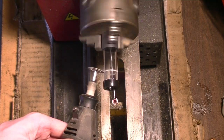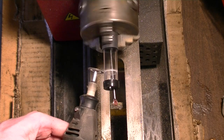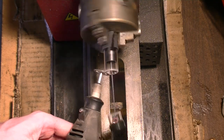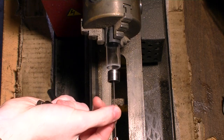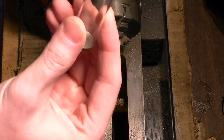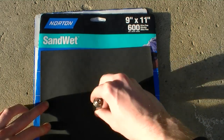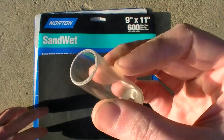This operation creates a lot of dust so you'll want to wear a mask. This cut is a little rough so I'll sand it a little. After I sand the end of the cylinder I run it under hot water to remove all the dust particles, and then I dry it thoroughly to keep the steel end from rusting.